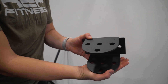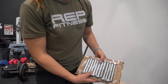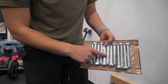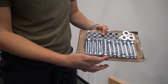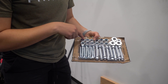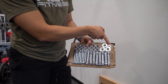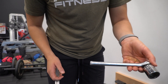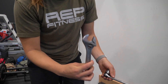We give you both mounting options. These are the bolts that go through the bracket to keep the cross members on, while those keep the uprights on — you want the fully threaded ones to go into the brackets. These are our wedge anchors if you're going into concrete, our lag anchors for wood like we did, and the locking bolts we always include with some washers so those bolts aren't backing out. You'll just need a 15/16 socket wrench and an adjustable wrench for the other side.